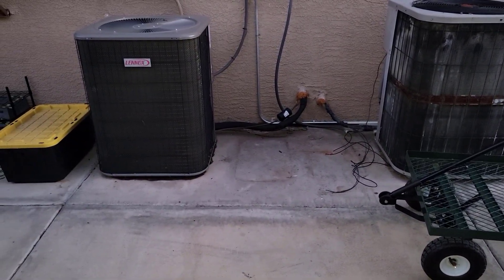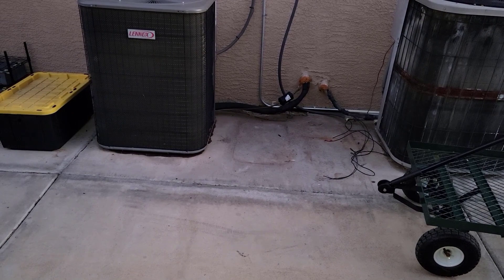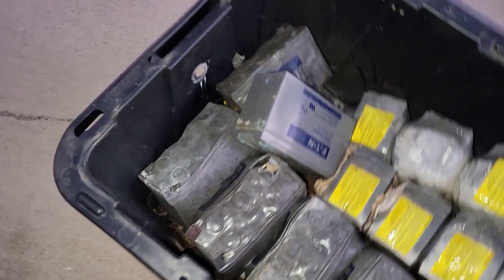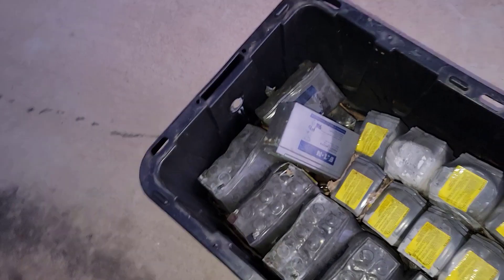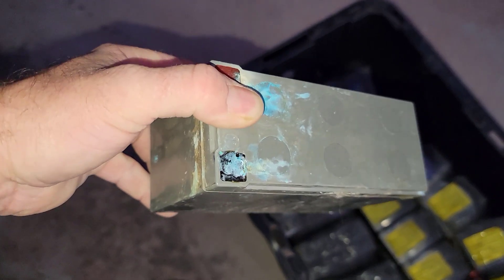When I was just connecting this I knew this was gonna happen if I neglected it — I never had a charge controller hooked up to disconnect the batteries once the heat pumps weren't running regularly enough to keep the batteries from overcharging. It wasn't an issue through the summer, but I knew when summer really ended that would happen, and it did. I come out here, open the cover, and one pack of my batteries is totally swollen — just completely destroyed, melted around the wiring.